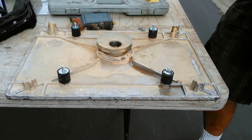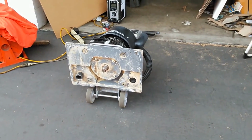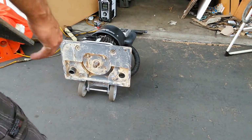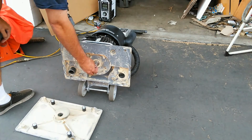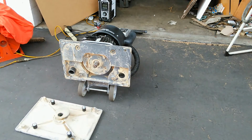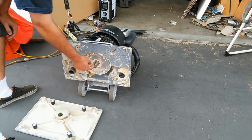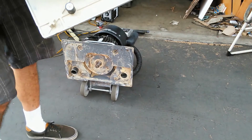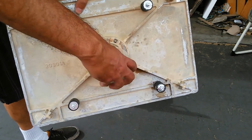Pull these guys off. I'm going to pop that pad back on there. So there's the machine right there. Now, the reason I put this screw back in here, or this bolt back in here, is because there's actually a pin in here that fell out when I was taking it out, but it's a registry pin. It actually goes along this part here, and it registers the oh, here it is. It registers this to lock this on to here, because this is an eccentric.